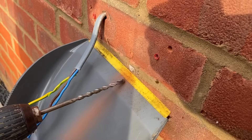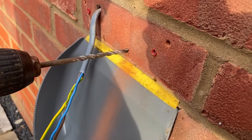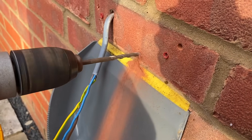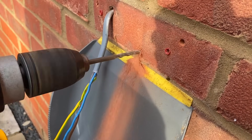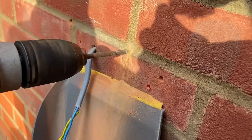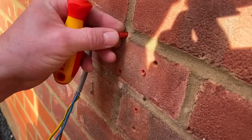Once those four fixing positions are located, I pull it back off and check those marks on the wall — I can see the black dots and now I can drill out all four fixing positions. I'm using a dustpan to catch my brick dust for two reasons: I don't want to sweep it up off the floor, and I'm going to use that brick dust to make a repair to the holes that will be visible with the new position of the socket. The cable previously came in at the top corner but now comes into the back, so a couple of holes on the right-hand side will still be seen.